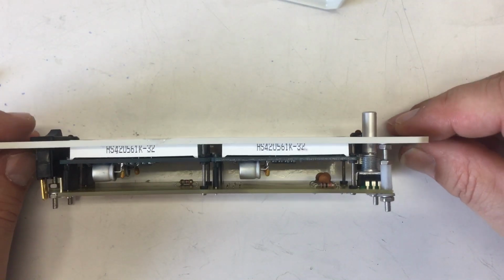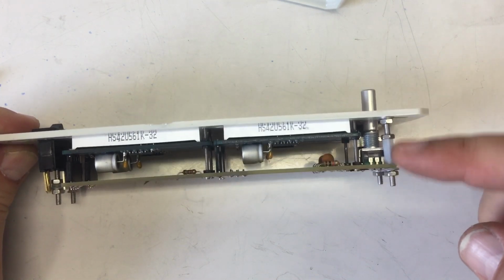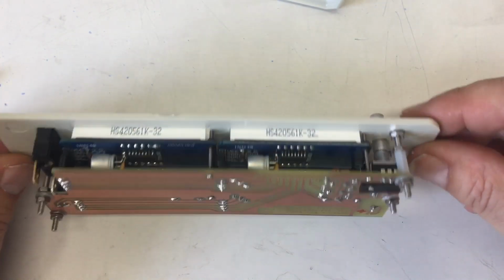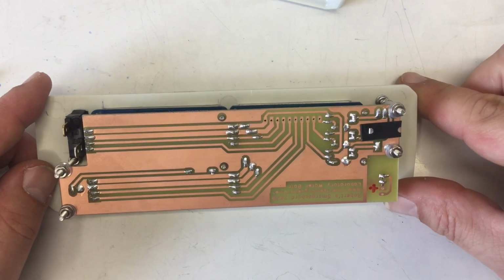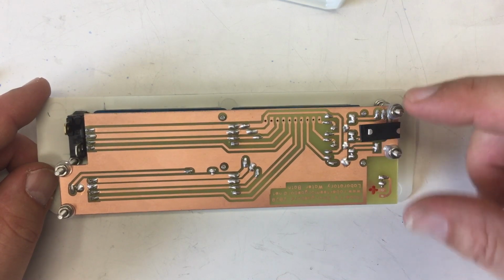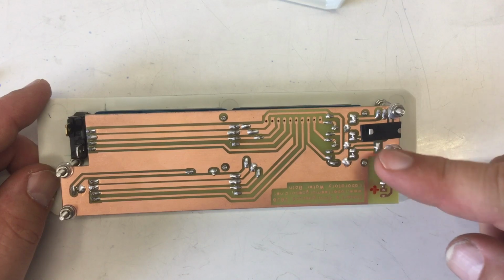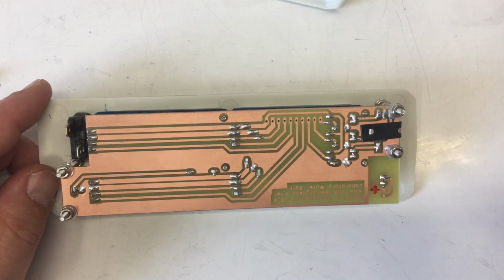Anyway, word of note, the isolation here on that screw, and I measured it. I made absolutely sure these screws have no connection whatsoever to these pins here and to that copper. If I had space, I would place the screws with a little bit more distance, but I hadn't. Okay, and I can't go into this area because this area is connected to mains AC.